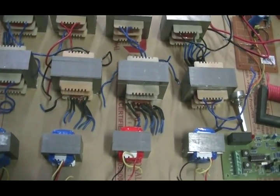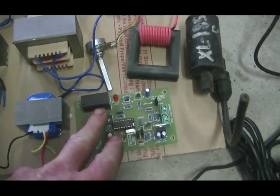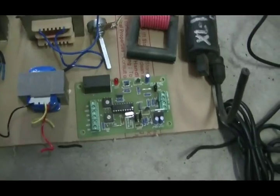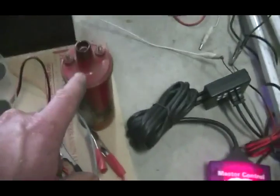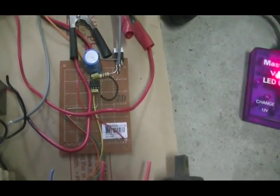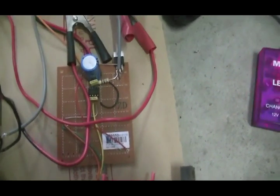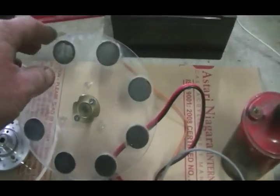Then we have to unwrap the wire and wrap it all back up. My pulse timer kit will be used on the second pulse motor. I have one high voltage coil here and another here — not sure which one I'll use yet. This one's a little better for higher frequencies. The pulse width modulator I made up I'm going to change a bit and also add frequency adjust on it.